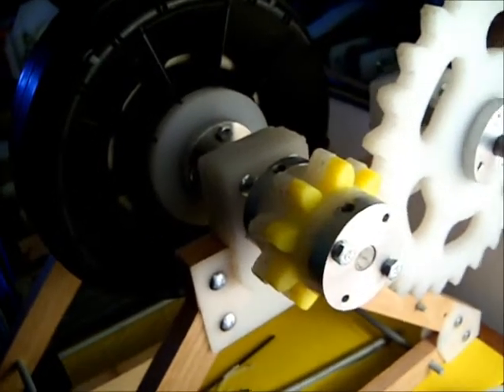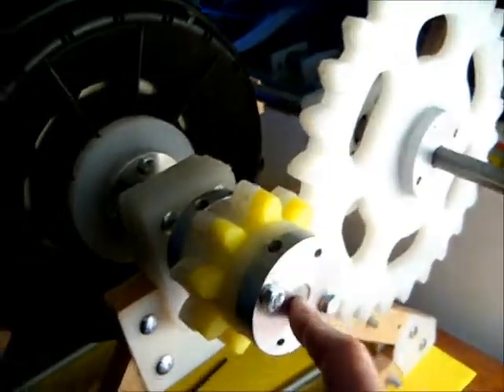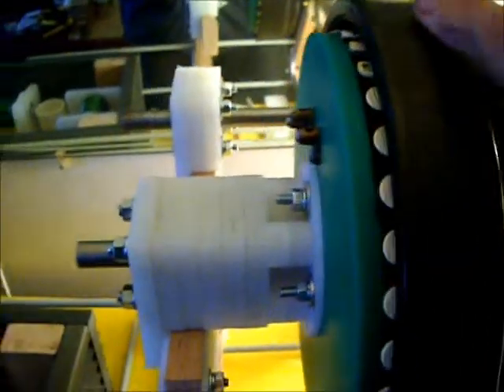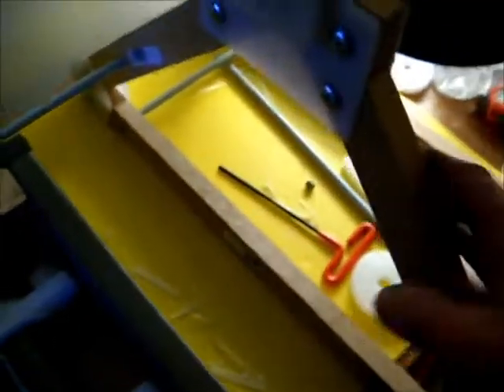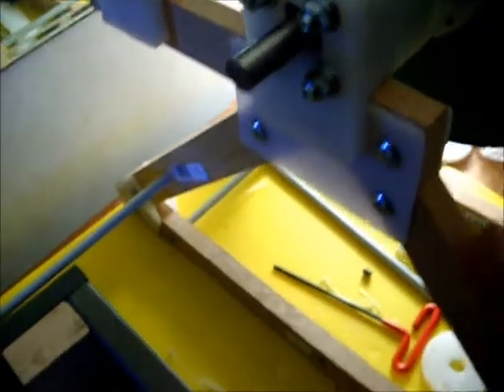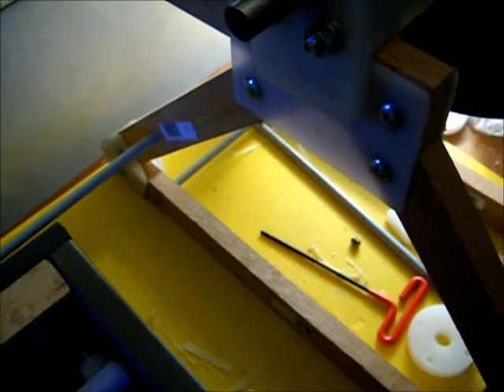Fabricating a manual generator, part 1 to 3. Getting the stator to line up with the rotor so it doesn't bind is a real challenge. We had to extend or use multiple bearings on one side to keep the center shaft perpendicular. Just using some fiberglass rods, three-eighths inch, for the frame and some oak pieces to facilitate the fabrication.